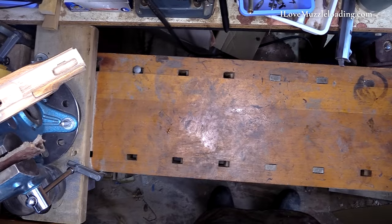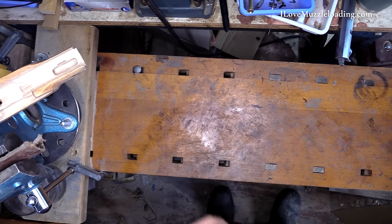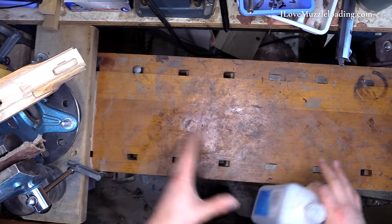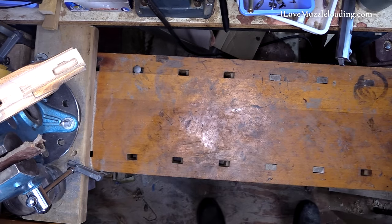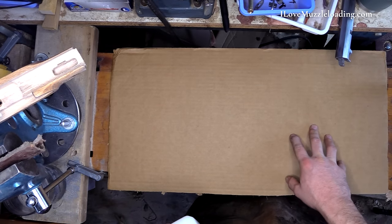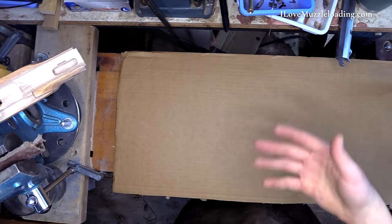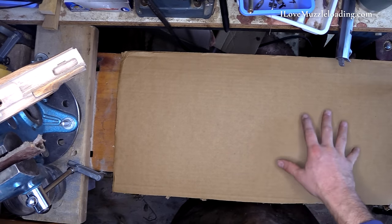I'm giving this a nice deep rub of water and letting it sit there once again to dry out. As that's drying, I encourage you to take some time to clean up your workspace. You can see I've gotten most of the dust off of my bench here to start my metal finishing prep. We've got our bench cleaned off and we've got some supplies. First, I've got just a scrap piece of cardboard to put down on my bench — this is going to keep any solution off my bench. When we're dealing with rust browning solutions, it's important to keep things away especially from your tools.